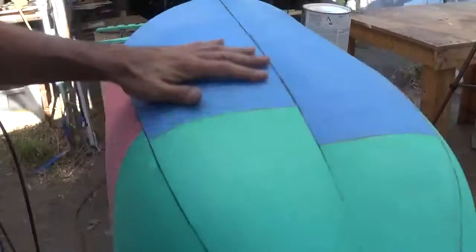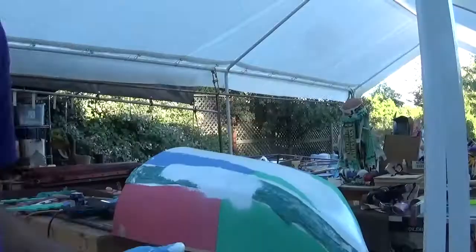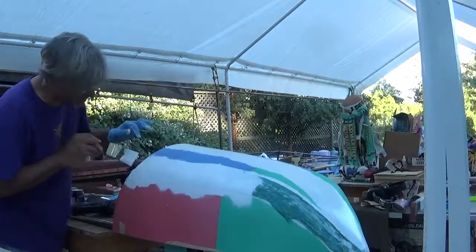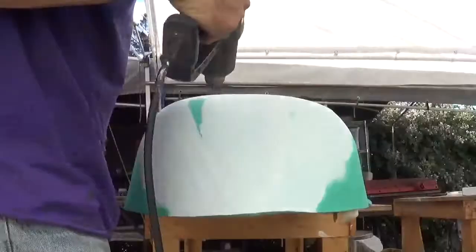Well, that was a pretty big day. I've got the aeroshell on the front of the hydroplane. It's just floor mat material. The corrugated side doesn't stick to anything very well. It's got a mold release on it, and so I'm going to put that on the inside. And the outside I will skin with fabric and gripper paint. I have to let the seams cure for about 24 hours, and then I can come along with the heat gun and finish shaping it.